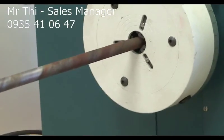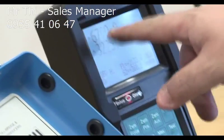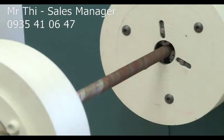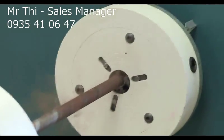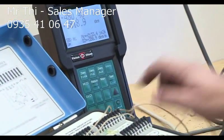Okay, 2400s and going. If you look carefully, the torque is not increasing. The torque is not increasing, which is the plastic region, while the twisting is increasing without increasing the torque. So it's like fluid. Good. And again, the circle, I'm going to stop it here.